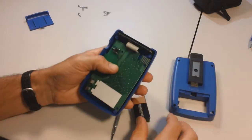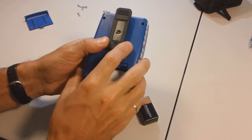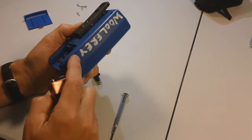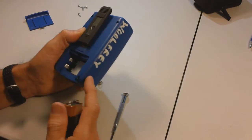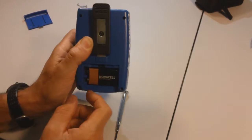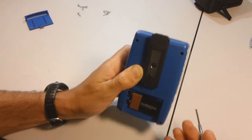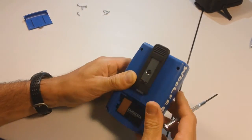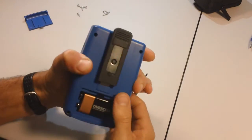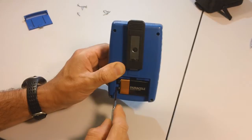The problem is the battery doesn't make very good contact with these leads when the case is mounted together. Good, reliable battery contact with the leads relies on a two-piece case — the top half which is mounted to the bottom half. The top half pushes on the battery to make good contact with the leads. In the hot sun or something like that, you've got a flaky case — the thing gets warm and you may intermittently lose contact right here.